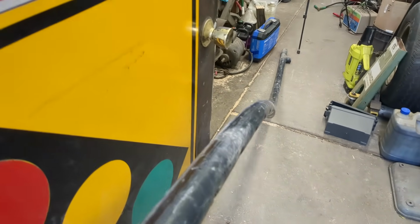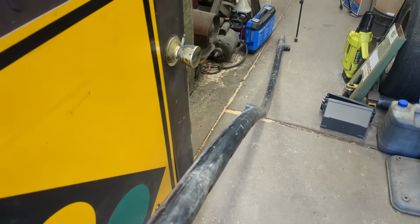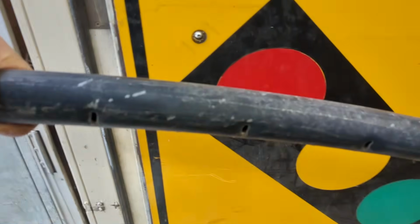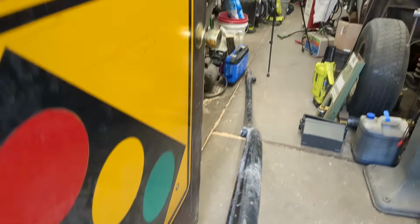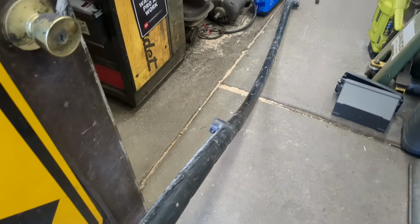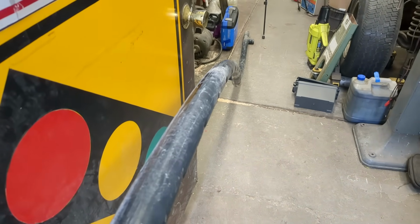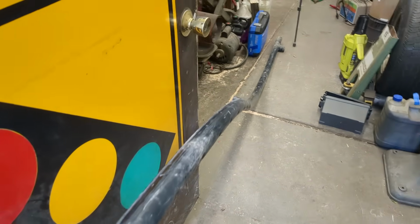If this is the ramp form, I mean, it's way too long. It's almost 11 feet. But you drive up the first part, and then it's just nice and gradually rounded into the pickup truck or whatever. But we're way too long. We need to shorten this down. If you're making ramps, make them as long as possible, but have a nice set of 8 foot that are straight, and you virtually never bottom out on that. The longer they are, but also the longer they are, the weaker they are. And I want these to be rated for about 2,000 pounds.